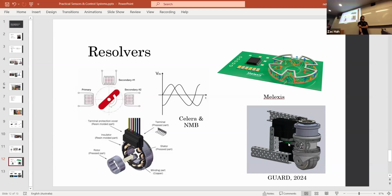Yeah. I would read the documentation for CAN. It'll tell you exactly the best way to wire things up. So for example, when you twist the CAN wire, there's actually a certain distance that the twist has to be. And then when you terminate them, what resistance that has to be, and make sure that the lengths of the two wires are the same across the whole length of the thing.